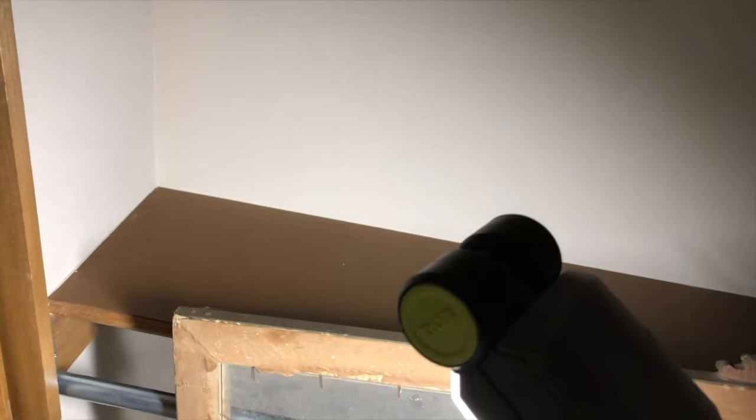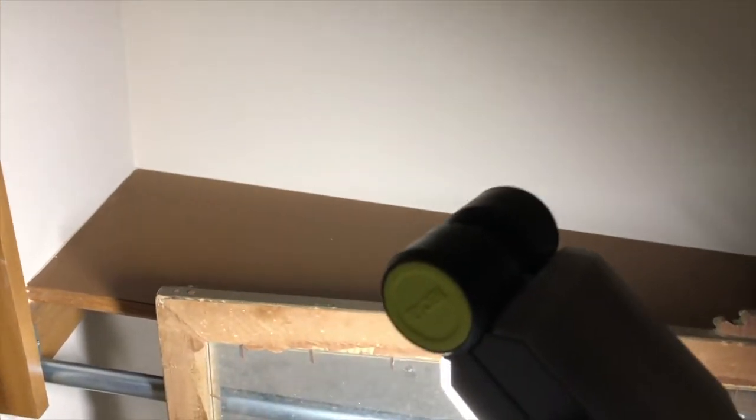This is gonna be my comm closet. And get a light. My plan is to pigtail off of that outlet to put a new outlet in right on this shelf, right inside this closet. This will house the security system and the switch that goes to the access points.